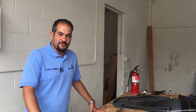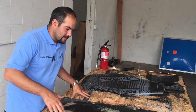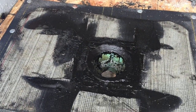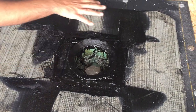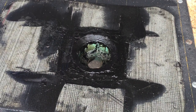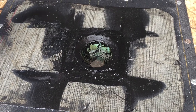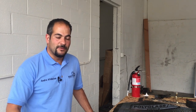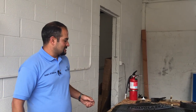We're ready for our final step at this point. We already have our smooth membrane down. If you take a closer look, we've got all the hot asphalt and hot bitumen surface coated with the melted torch down, and all the corners sealed. Even at this point it's going to be a waterproof drain — temporarily. This is not our final layer; we still have one layer to go on top. But since these drains are such a pain point on flat roofs, we want to take those extra steps to ensure a second and third layer of waterproofing if our primary waterproofing membrane fails. So let's install the torch down.